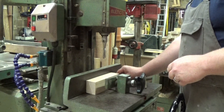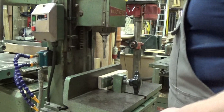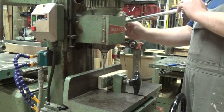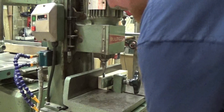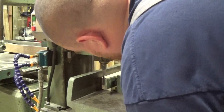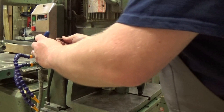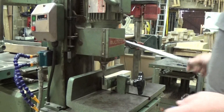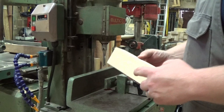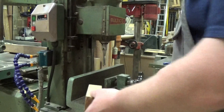Take our wood that we're mortising — it's already been marked out nice and clearly. Just adjust this handle so we're not moving things quite so far. The first thing we want to set is the depth. In this case it's a through mortise, but we don't want to plunge all the way through as that's going to cause damage. So we set our depth to somewhere around about three-quarters of the way through. Once we clamp the wood in, we've got a face side and face edge mark — always want to be working with the face side and face edge against that back fence.